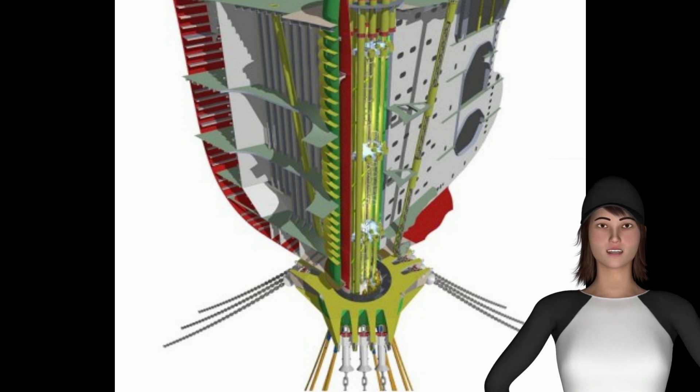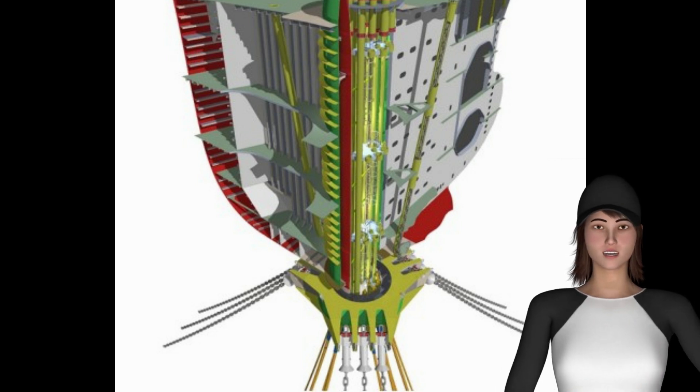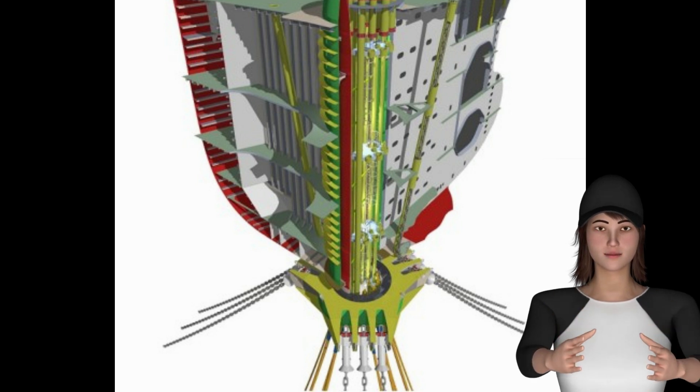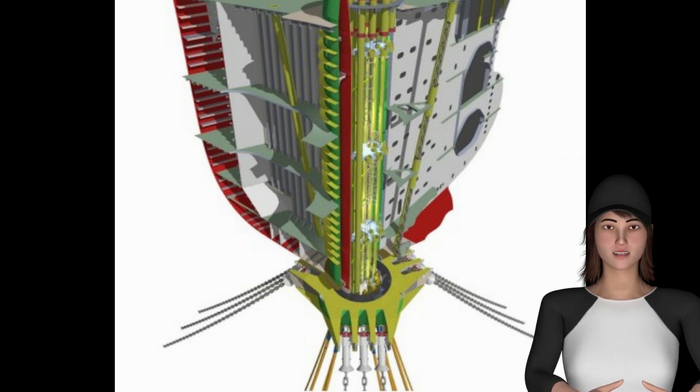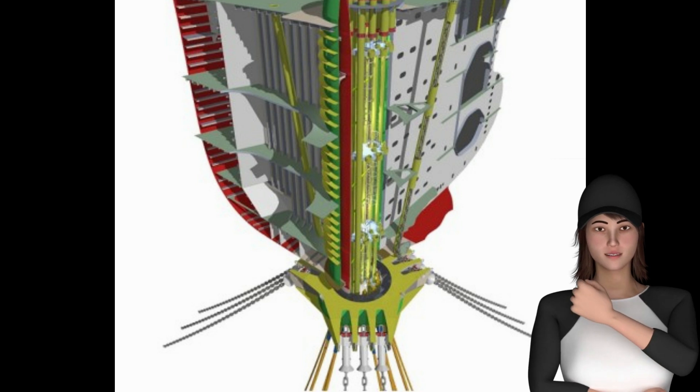The turret is also connected via a large diameter sliding bearing at the bottom. The slender turret shaft ensures that the horizontal loads from the risers and mooring lines are transferred via the sliding bearing to the vessel, while the remaining forces from the turret and the vertical loads from the risers and mooring lines are transferred via the 3-race roller bearing.